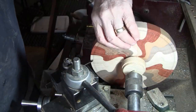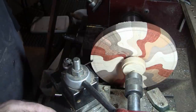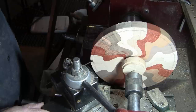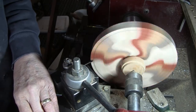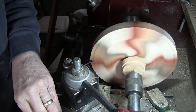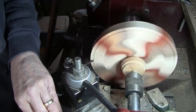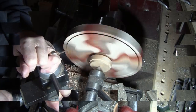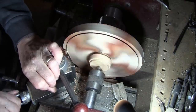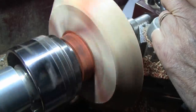I've got the board cleaned up and made parallel to 0.83 inches. The disc is mounted in my little metal lathe. I'm using that because I have a compound set on an angle, and I'll cut three rings from this disc. Because all the angles are the same, all I need to do is measure each ring and cut it to fit on the one it glues against. Then everything should line up just right. It actually left a pretty clean cut.